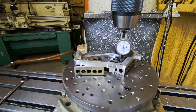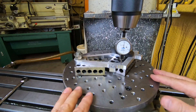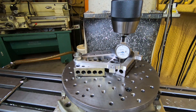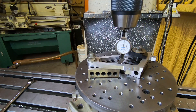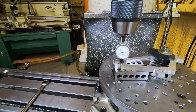When I hit that second point, the Cartesian display calculated the angle necessary to cancel out the error and make this surface parallel to the X-axis. It tweaked itself a little bit. Now let's see how close it got — I'll bring the indicator down and pick up a zero here. We got almost no indicator deflection, which means this surface is nice and parallel to the X-axis.